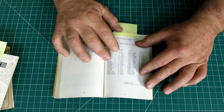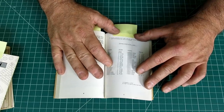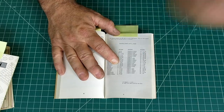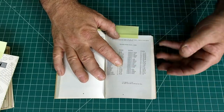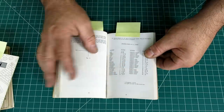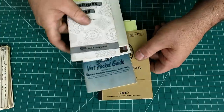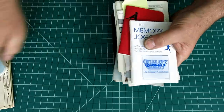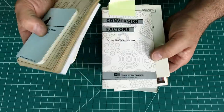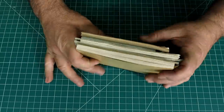It's kind of a handy chart though. The one I remember is the sine of one degree is 0.0175 — so 17 and a half thousandths at one inch. From that you can extrapolate and estimate angles just by looking at them and taking a couple of quick measurements. You can compile this in Excel too. Anyway, that's the books — the secret viewer who sent these, thanks. These may end up with Keith Rucker for scanning to put on the vintagemachinery.org site.